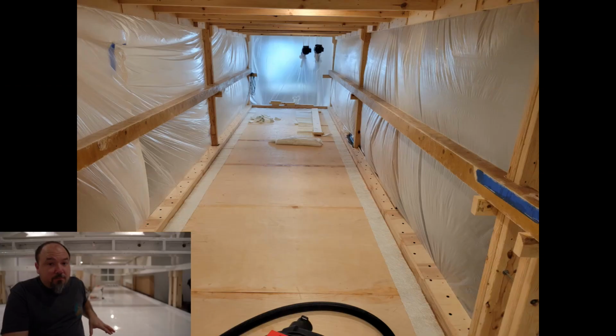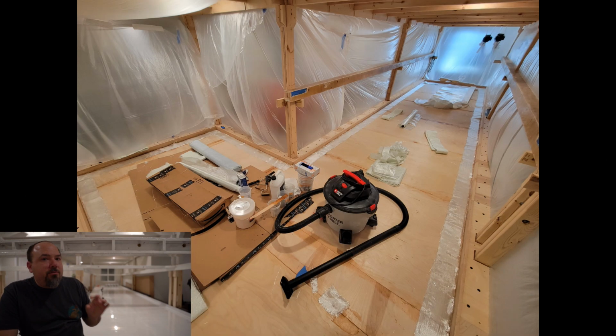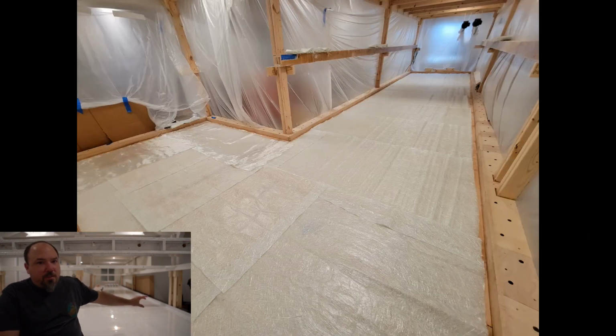With the 24-foot, 30-foot beams complete, it was time to move on to fiberglass on the bottom of the tank. I prepped all the fiberglass for the bottom seal beam perimeter first, followed by both layers of the bottom of the tank. Now I do want to point a couple things out. First off, for the bottom seal beam, I used continuous pieces of fiberglass for every single side, including the 30-foot sides. I did not want any seams, especially on the glass seal face.